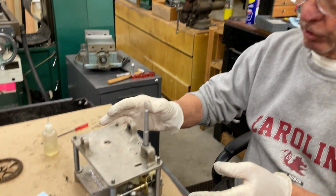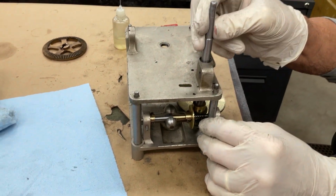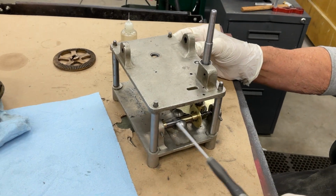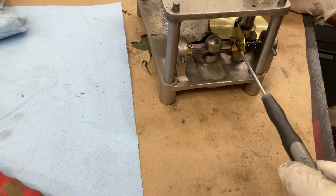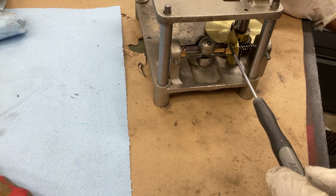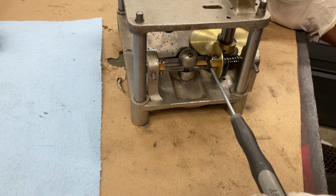Dyslexic Genius here. I'm back on the Pathe governor and gear assembly, and these motors are usually set up pretty loose, like the spindle shaft. So what I've done is I've shortened the governor springs. I enlarged the governor springs on this side, trimmed them down, and enlarged the holes so I could bring it this way.